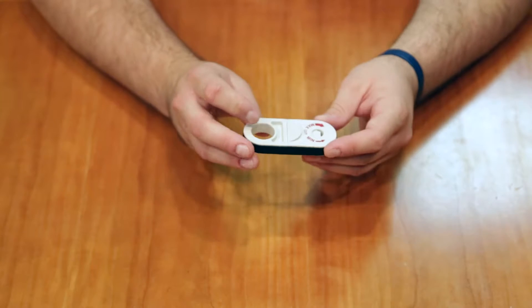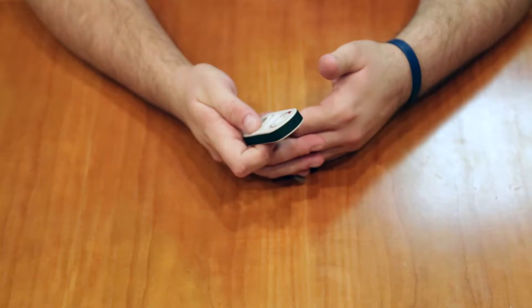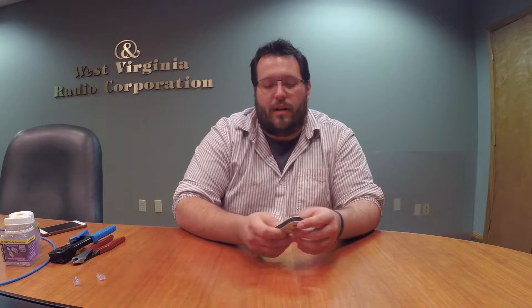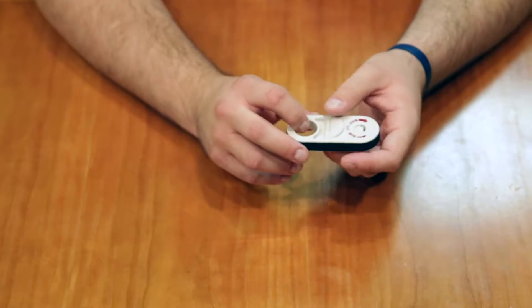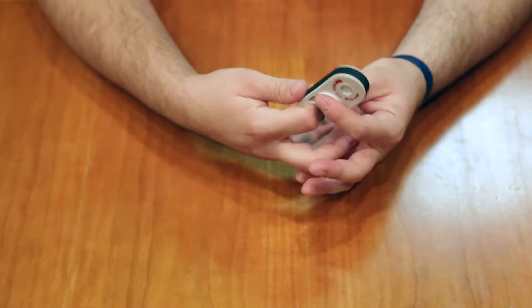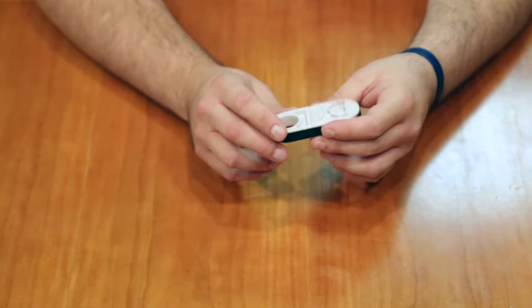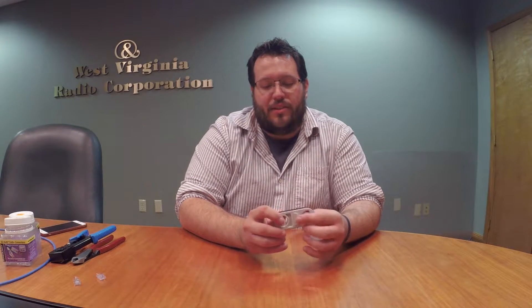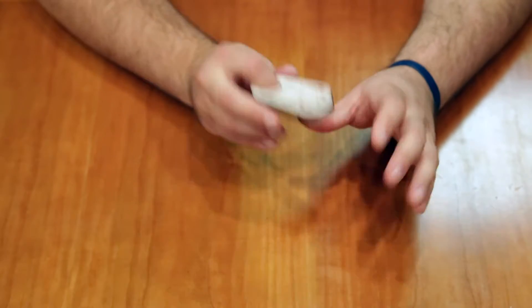Let's take a look at some of the tools you're going to be using when making these cables. You need a good cable stripper — you have to strip back some of the cable jacket to get to the pairs of wires. This is from Platinum Tools, called the Cyclops 2. It's very simple: it's got an elastic band around it, you stretch it open, put the cable through, and rotate it around the cable. When these are brand new, the elastic bands are actually so tight they might nick the wires inside the jacket, so pay attention to that and work it out first.